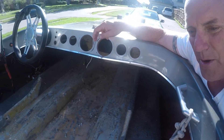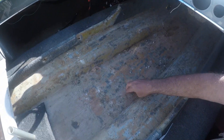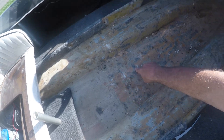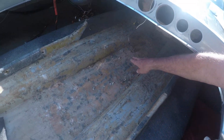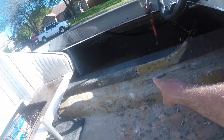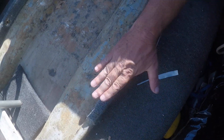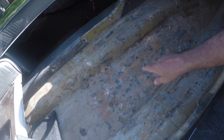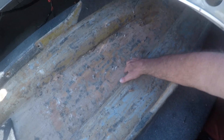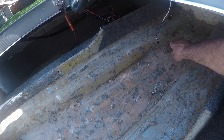The damage was this broke right here - that's the minor one. This false floor I put in after I bought the boat. These studs right here is where the diverter control mounts, these studs right here is where the hot foot mounts, and the seats bolt on these holes. There are aluminum brackets and the seats mount on top of the aluminum brackets to the stringer. The stringers are solid - that didn't even bust loose at all. My false floor on this side busted loose.